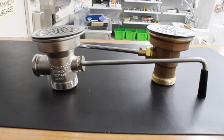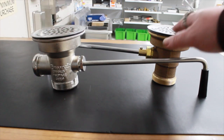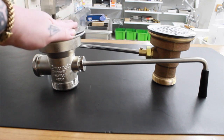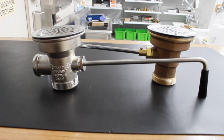When it comes to both drain assemblies, you can't go wrong with either one. The twist-turn or lever-style drain is very economical — almost half the cost of the Fisher ball valve drain — but very repairable. So if you're looking for an economical drain that just does what it needs to do, the twist-turn drain is the way to go. If you want long-term operation, go with the Fisher ball valve drain.